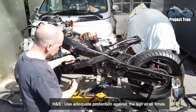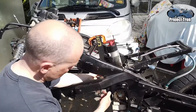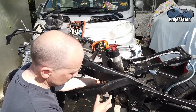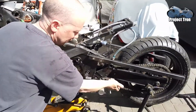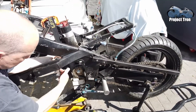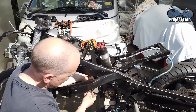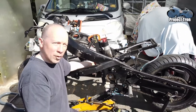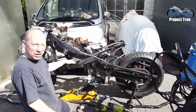All these brackets are going to be welded in. This one fits here, but this is going to be unusual because that will be welded in, and then there's going to have to be a tensioning system because we need to tension the chain — you can see at the moment it's just too slack. So what I'm going to do is weld that on there, have an adjuster here, and it will pull this bar backwards and forwards, which will allow us to tension the chain. Then when we put power on it, it should go. That simple, really.